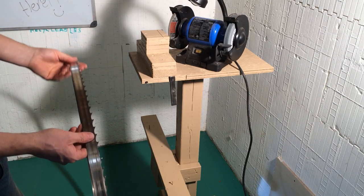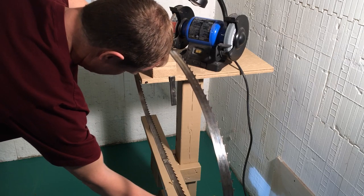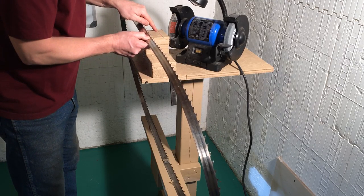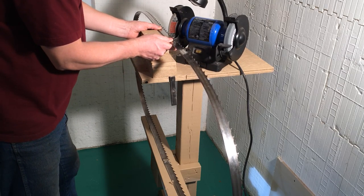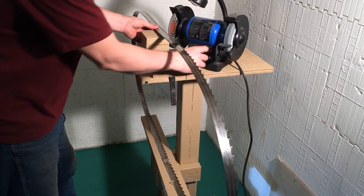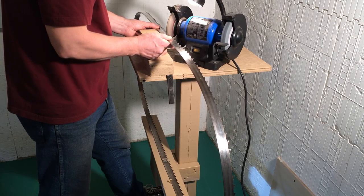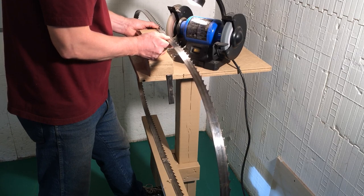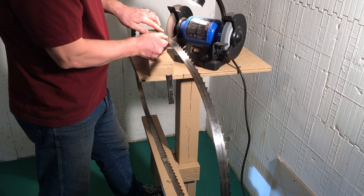You can't saw like this, you can only sharpen it. You would start at the weld and put the blade on the blade support. Pull the back of the blade up against these screws — they can be set wherever the blade is level up and down. There is a guide cut into the headrest here to show you the angle of the blade. You're going to start at the very tip, slide down, and then kiss the face of the tooth. What you're doing is grinding the same amount off each part of the blade. You don't want to hold the blade in the sharpener too long at the bottom of the gullet or you'll carve a small path into it.